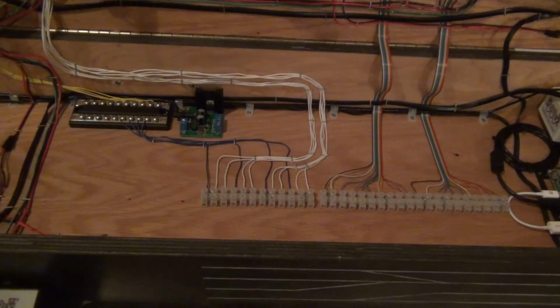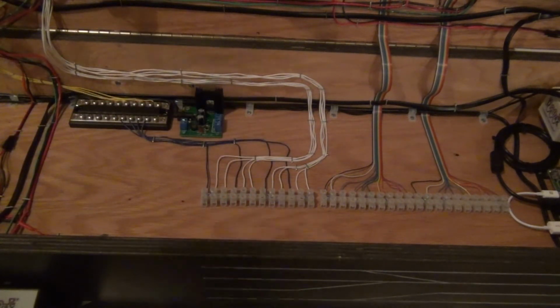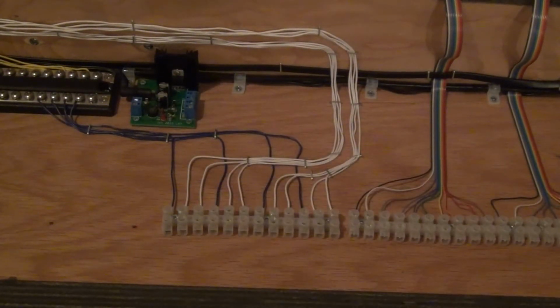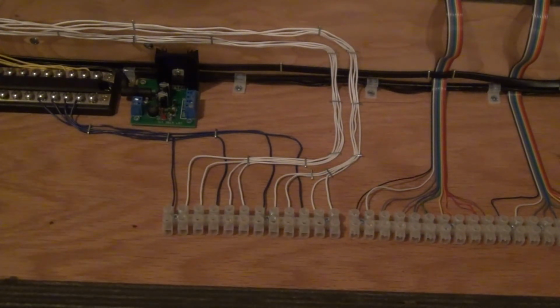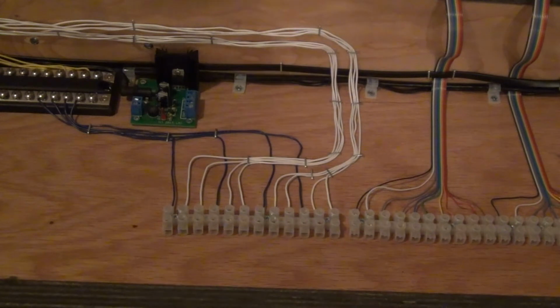It will just magnify the resistance coming off the potentiometer, and it'll serve the purpose of dimming the lights. So I want to talk just real briefly about the reason why I'm doing a resistor coming off the potentiometer. Ordinarily, if you were going to use either of these power supplies for anything other than LEDs, you don't want to have any resistance. You want the full 12 volts. So basically, resisting the current coming directly from the power supply, it is going to be less than 12 volts running through that bus bar.